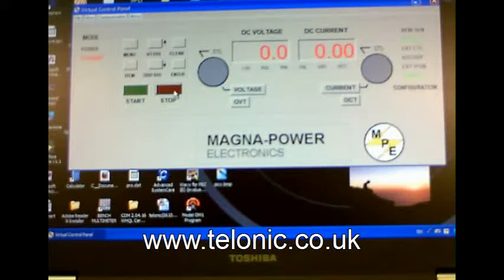Other standard features of this power supply are remote sensing of output voltage, over voltage and over current trips which protect both the power supply and the equipment you're testing, and external analogue remote control. Options include GPIB, USB, Ethernet and RS485. The MagnaPower XR series. We'll see you next time.